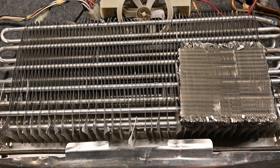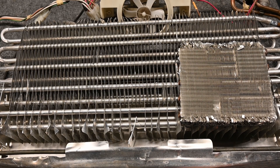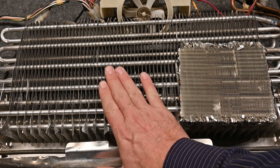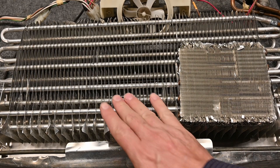Typically with a walk-in cooler or any kind of cooler, you don't typically have a defrost heater, although I have seen them. You will have a defrost heater of some sort on any walk-in freezers. This domestic refrigerator - the top section where the freezer is - works the same way as a walk-in freezer, just a lot easier to handle.